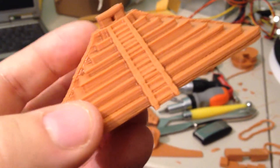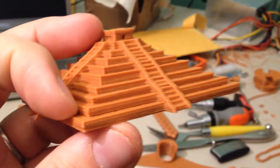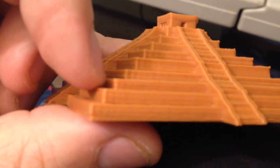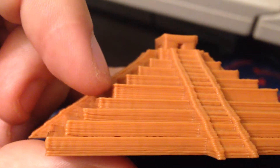The problem is that the Z-axis problems I've been seeing, where sometimes it doesn't go up, where that won't turn much, and it doesn't go up the full 0.4 millimeters it's supposed to — I think that can be seen here. I let it print without me being here, and you see that step right there seems less tall than the ones before it. That one seems much taller.